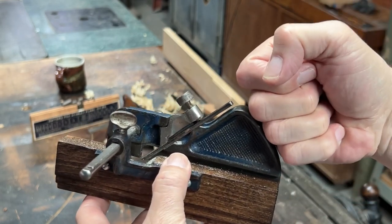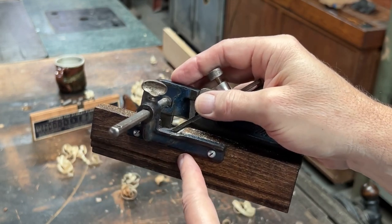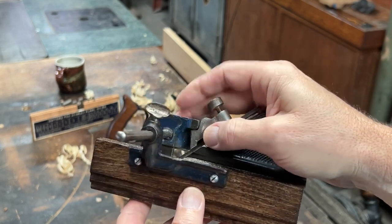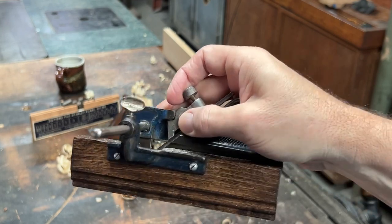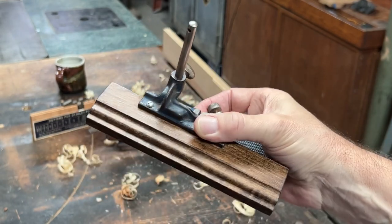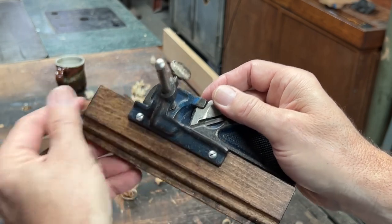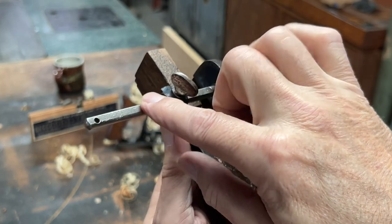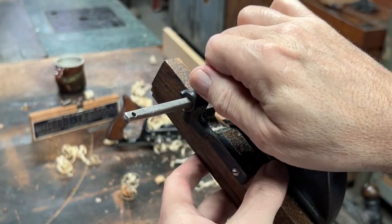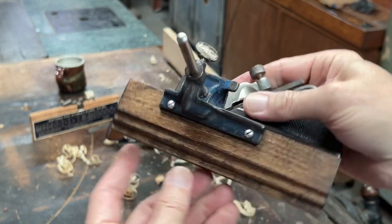This is really interesting because it doesn't have that handle like the 50 — it has this little palm spot here. If you use this without the fence against something else, you're going to have to put your finger somewhere. This indentation here is meant for your finger, but I do find the shaving comes up through there and my finger gets in the way. When using the fence and keeping your hand out here, the shaving shoots right up through fairly well. This is a little maple fence added to the original fence and stained dark. It has a flat top surface to tighten the wing nut onto, but you really have to put quite a bit of tension on that to stop it pivoting when you're planing with some force.